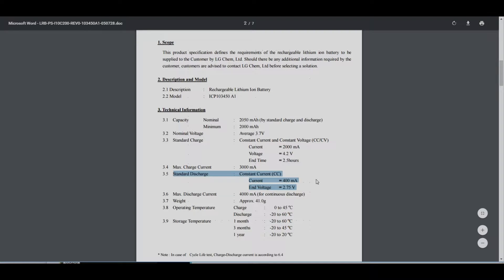I'm going to discharge this battery at 500 milliamps, which is half of an amp, and stop the discharge at 3 volts. It might not be the exact battery profile of this particular cell, but based on something very similar, I'm going to base the test on that. It's not very scientific, but I think it'll be within the ballpark.